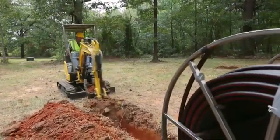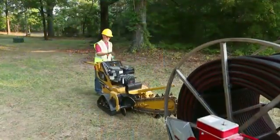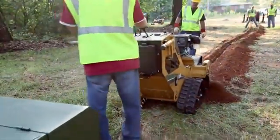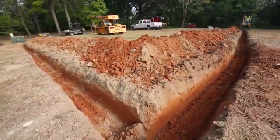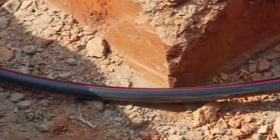Typical installations usually follow trenching or directional boring applications. For open trench applications, the trench should be constructed with consideration that every deviation in elevation or direction will have a negative impact on cable replacement tension. The number of 90-degree angles in the trench should be limited to four. Proper trench preparation can help assure the least resistance to cable pulling.